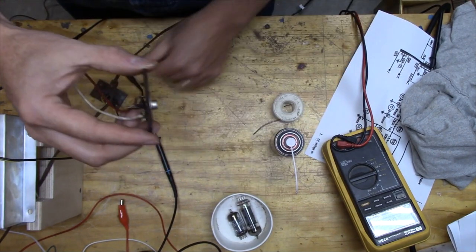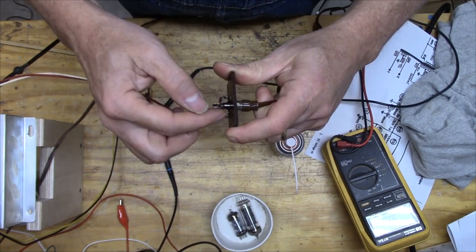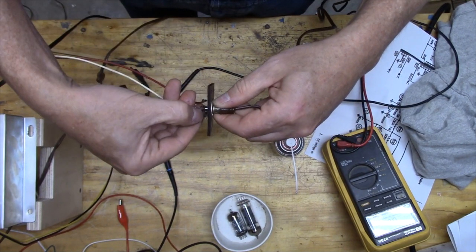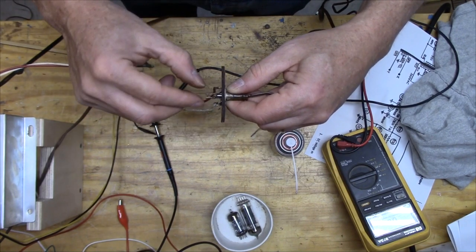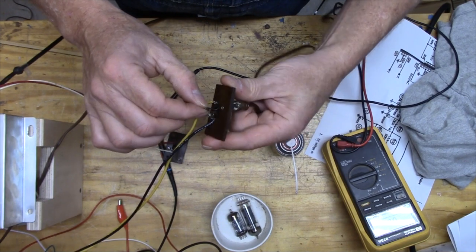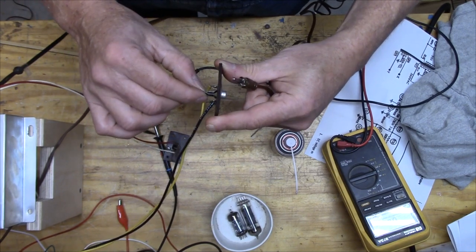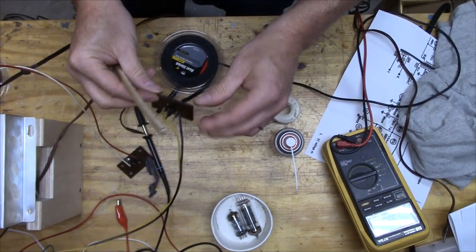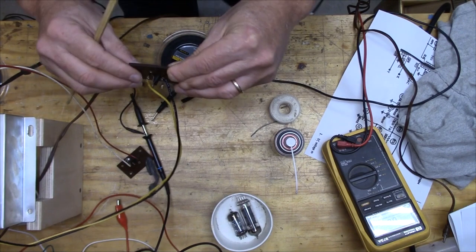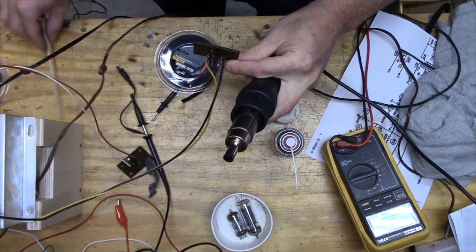Here are these weird shorting connectors. They've got a little piece of paper in there so when you plug a speaker in there's an insulator. When you pull it out, they short together — the piece of paper keeps this from shorting across these two contacts here. On this one the paper broke off on me, so I'm going to try to slip some shrink tubing on this side to take care of that problem. That should give enough room to insulate that lower part. Let's try that out.